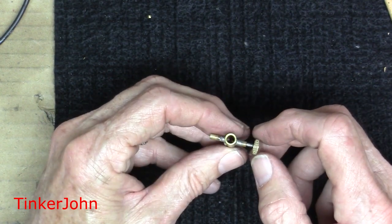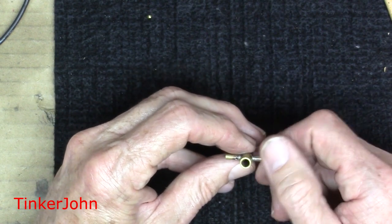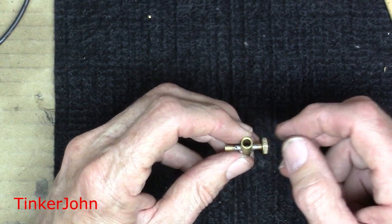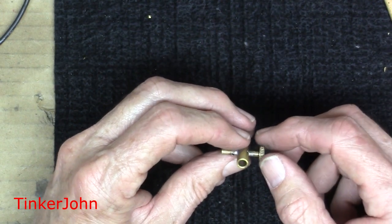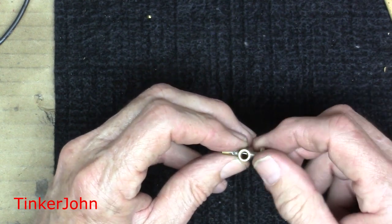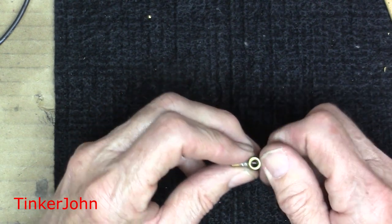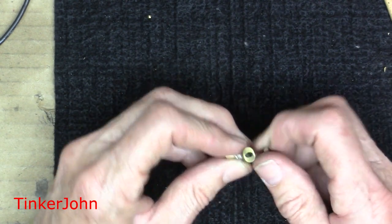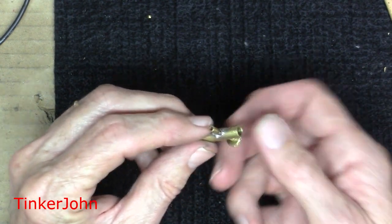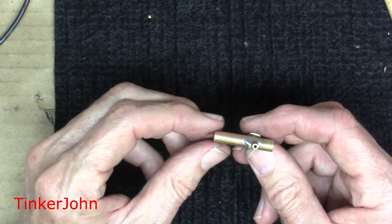This is just a regular soft machine bolt, so it's even more risky. What you want to do is wind this thing down to where it hits that jet in there — that's where the art and science comes in, because you can mess up too much there and not get a good fit. You want to crank it down and shove that needle up in there just a little bit, shaping that brass on the other side. Do that two or three times, then blow through there and confirm that when it's closed off you don't get any air leakage out of the ends of the carburetor.